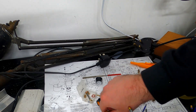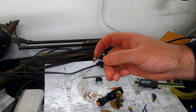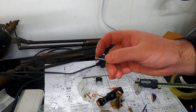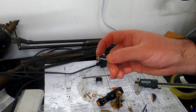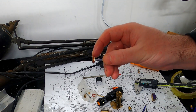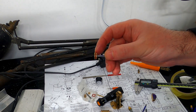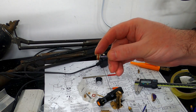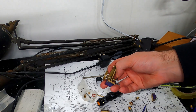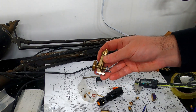I removed the cylinder and wasn't happy with how the piston was sliding inside. After some investigation I decided that the groove for the O-ring was not wide enough. It was deep enough, but the O-ring couldn't get fully seated because it was hitting the edges and protruding much further than it should — you only need a little bit of protrusion to take up that extra slack. Next up, the plans call for a hole to be drilled where the crankshaft goes through as a little oil port, so I'll go over to the mill and set that up.